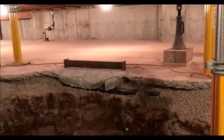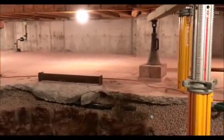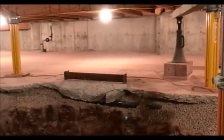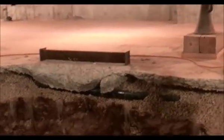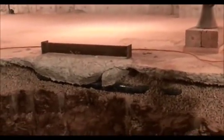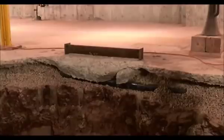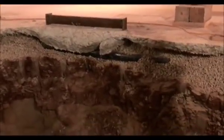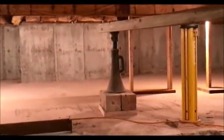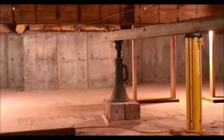Another good example of how scope creep can get you. I cribbed up to take out the first basement post — you'll see the two short shores there and the original post is laying down. The idiots who put the plumbing in ran the waste line right down the center of the columns just to save themselves a little digging. No big deal — shored up, and when the new posts get here I'll dig underneath and put the new pad and post in. And there's grandpa Jensen's barn jack — 120 years old and still working.